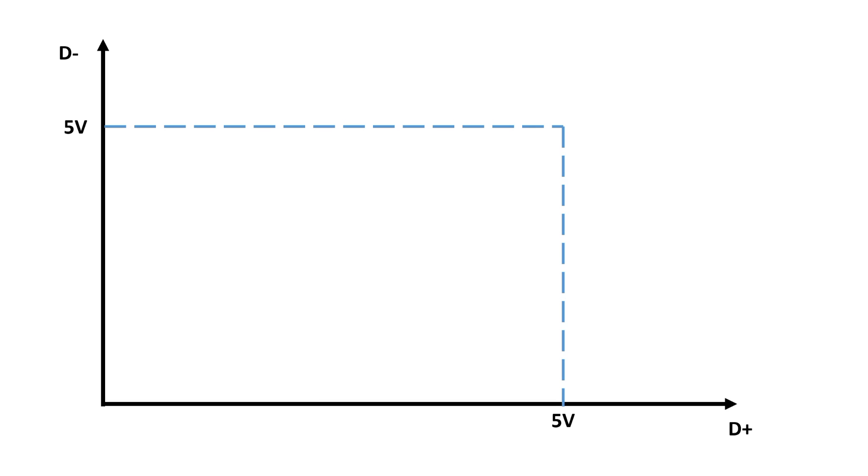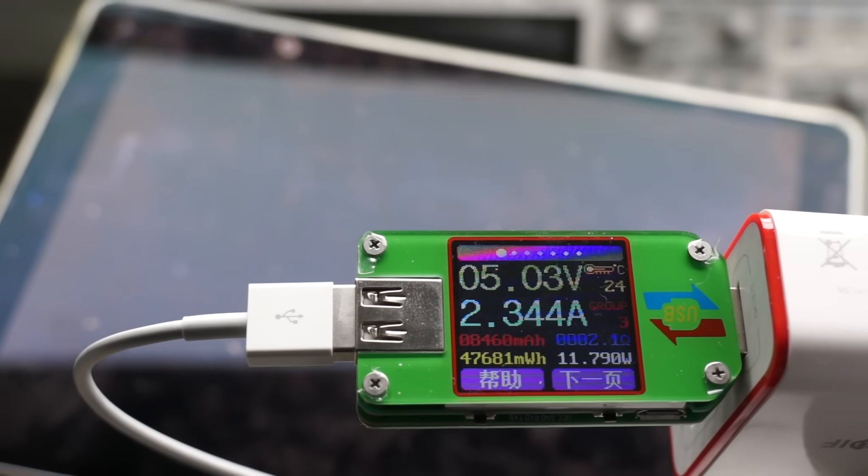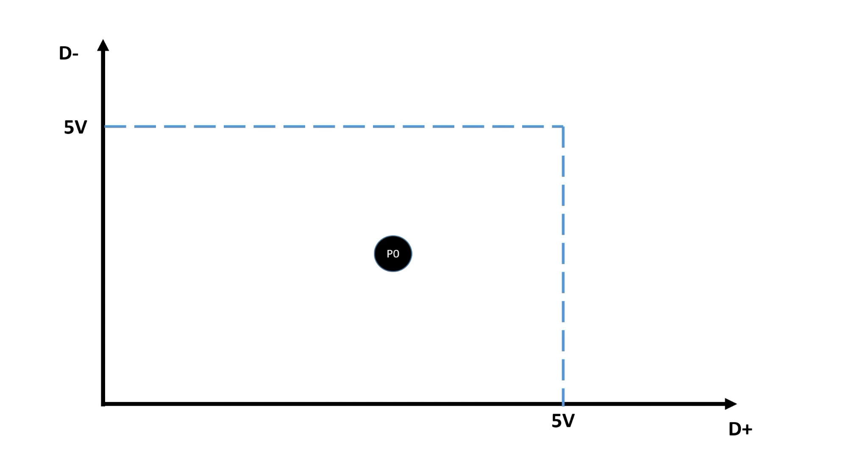A few possibilities exist. The first one: the smartphone does not apply any signals, resulting in no voltage on both data lines. I call this point P0. The standard says that chargers have to connect the two data lines at this point. Importantly, if your voltage on D-plus and D-minus are exactly the same, the charger is in standard mode and delivers 5V as all legacy chargers. In reality, P0 is not always at 0V — for this wall charger and the QC connector of this power bank, the voltage was 2.7V, which signaled my iPad to charge full throttle at more than 2A. But in this state, both data lines are short-circuited and not used by the QC standard.